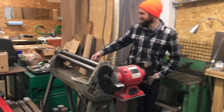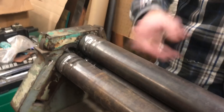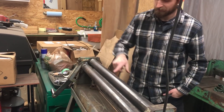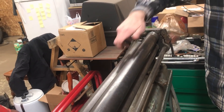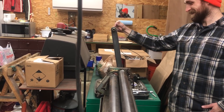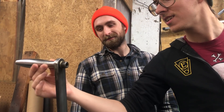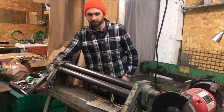And this is a ring roller — it's a sheet metal slip roller with a ring roller. It works on the same principle as the rim roller at Velocity. You're just rolling — running your sheet or rod into this roller, which is adjustable up and down, and that's how you adjust your radius. It's just a hand crank. Actually, I made this handle — I machined this on my old lathe. I was really happy with the way it turned out. It's just steel but with a nice high polish, so it doesn't rust very easily. And I'm always using it, so you're always keeping it clean.